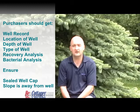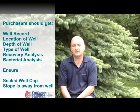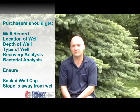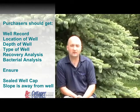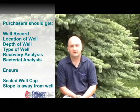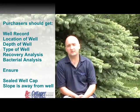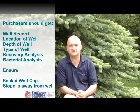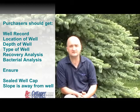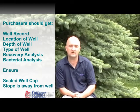You can have a certified well driller come in, set up a pump, and determine how many gallons per minute you're getting and the recovery rate of the water coming into the bottom of your well. When buying a house, you'll want to know the location of the well, the depth, the type, and that there's a secure well cap — preferably three to four feet above the ground so that groundwater can't contaminate the water source. You'll also want to check that the well casing has a slope away so that there's no ponding of groundwater around your source.